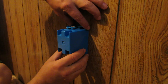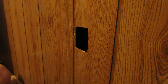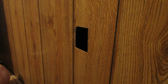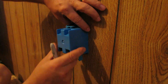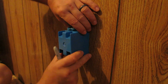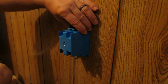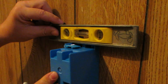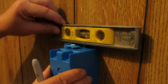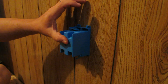What I need to do is set this box on the wall and then trim around the outside of it. I measured so these outlets are the same height on this wall — the quadruplex I just installed and then this one here. I've got a sharpie marker and I know I need to be at the top of this hole right there. The sides will be perfect, but I need to make sure the box is level, so I'm going to put a torpedo level on the top here to make sure I get the box nice and level.